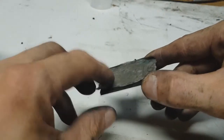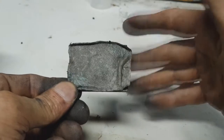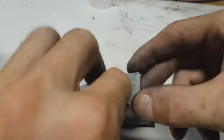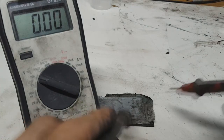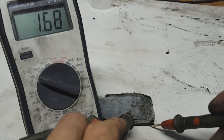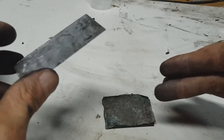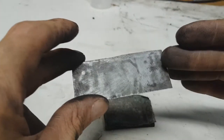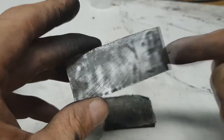On the bottom I have my active material — you can use what you want. First I will show you with zinc, so here you will not see any big improvements. The voltage is like an alkaline battery: 1.68 volts. What is really good about this electrolyte is that you can make rechargeable batteries, or if you make primary batteries, you can slow down the oxidation process.